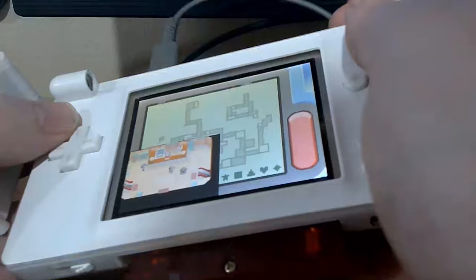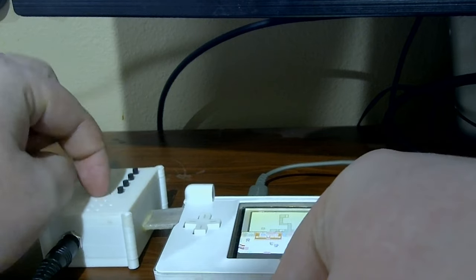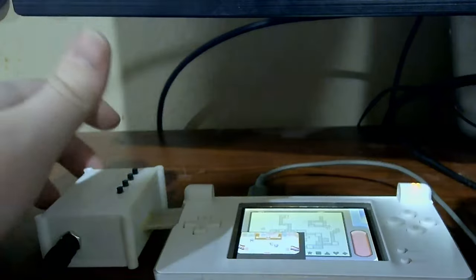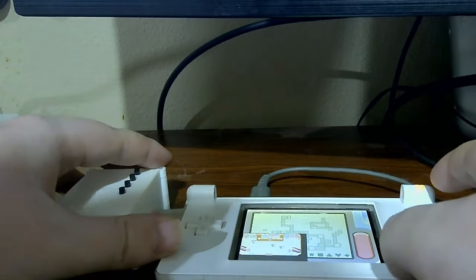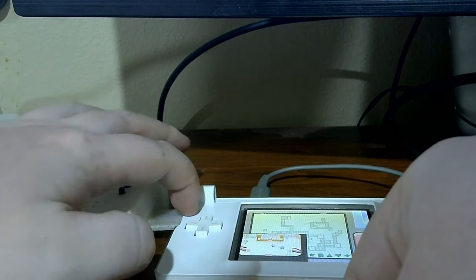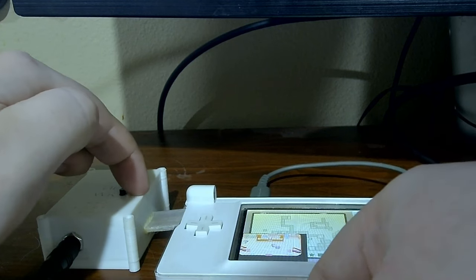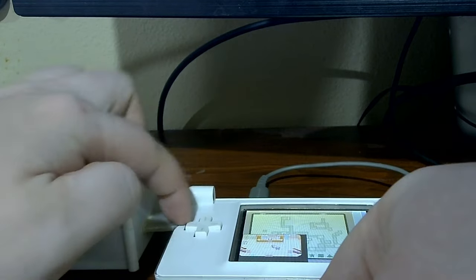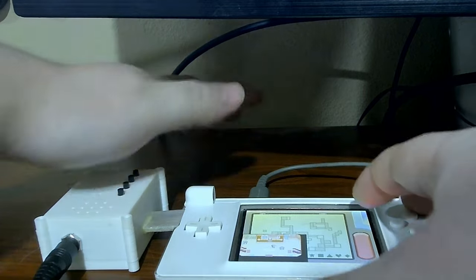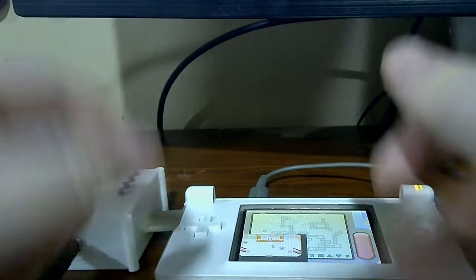The other option I was thinking about is dealing with the awkwardness of holding it. In theory, if we could get rid of this, it'd be helpful. My personal goal is to work towards a USB output here and a USB output here — rather than a ribbon cable, you take those ribbon cable inputs, wire them to a USB, wire the same inputs to another USB. Then all you have is a USB cable: your box back here, your console here, and just deal with that USB cable. You could put it out of sight with a decent USB-C cable.